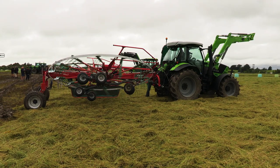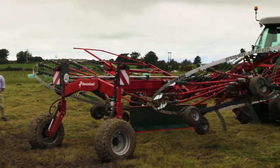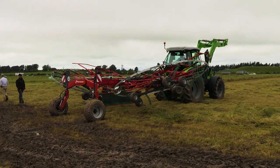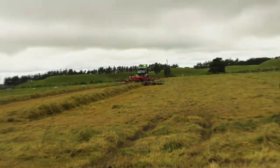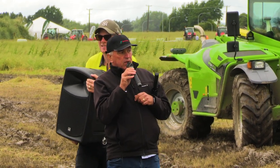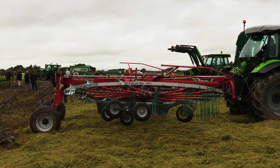The unique feature with our machine is when it's folded up, the back wheels are on hydraulic rams, so you lower the rake down and don't have to take the tine arms off to go down the road. It's adjustable hydraulically from eight metres to nine metres from the tractor cab. We run with cranked tine arms with what we call duro tine — the tines on the rake are staggered, not in a straight line, so you get a double raking effect. The crank tine arms lift away from the crop quickly, giving a lesser angle in the cam track, so less wear and a nice shape on the crop. The cam wheel and pinion is a bigger version of what we fit on the tedders — a sealed oil-immersed crown wheel with the pinion held by two bearings, one either side of the gear.